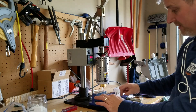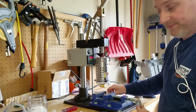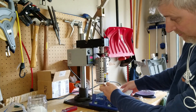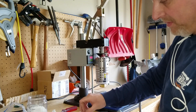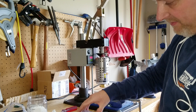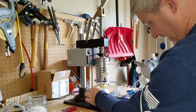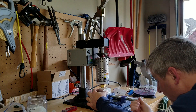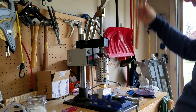After you get everything mounted, you have adjusting bolts here on the vise. Get everything heated — you've got to get the nozzle lined up with the sprue in the mold. This is the mold that I have for a tool that I sell. When you get it all lined up, you have to reach in here, line up the hole, and lock it down.